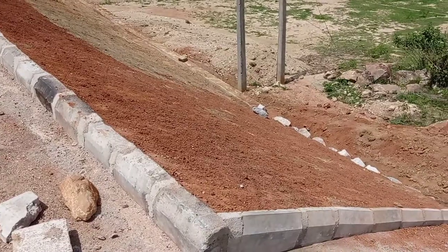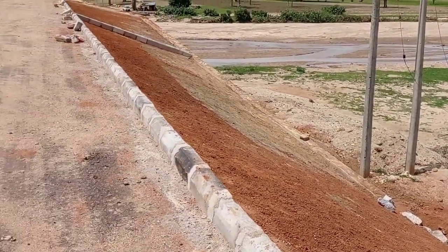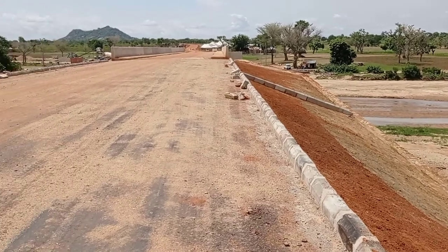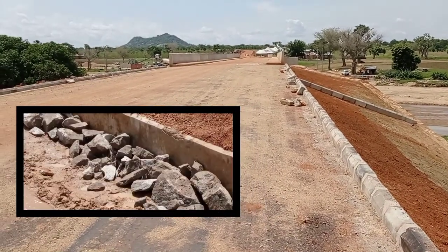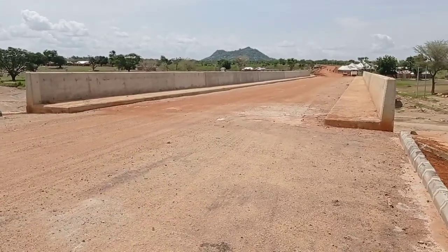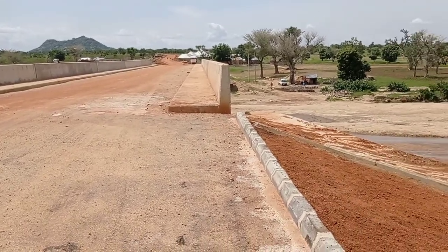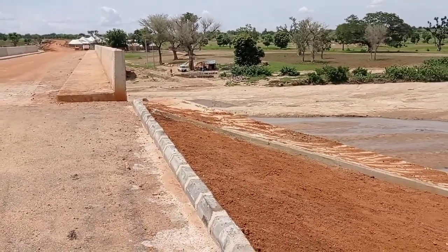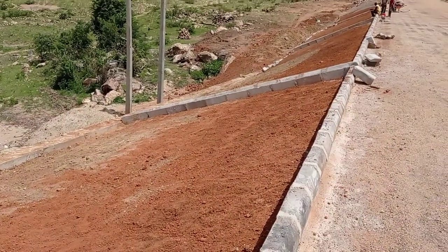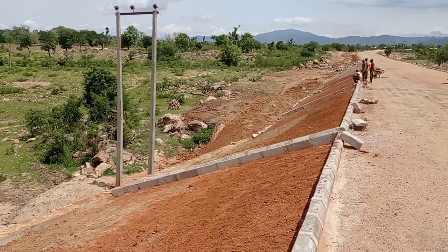After the well compaction of this area, we are going to lay our stones or boulders. For the curb stones, we kept 15 centimeters inside the ground while 15 centimeters projection was outside of the ground. When we are laying these curb stones along the shoulders of the road, we are also going to construct chutes so that the water may flow out of our road.